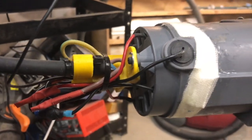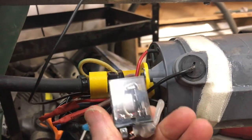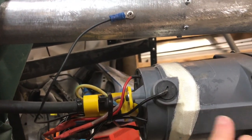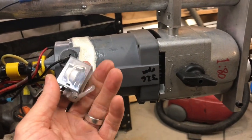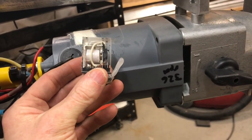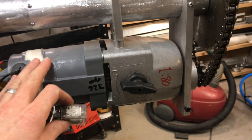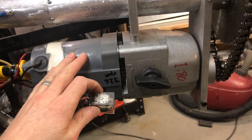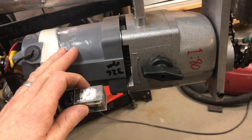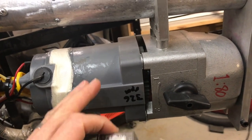Speaking of the utility vehicle, I had the same type of motor arrangement on those — just ordinary corded power drills. I used a high voltage relay to switch the current flow between the brushes and the stators to change the direction of the motor electrically and remotely. It turned out these relays are kind of wimpy for that. Even if you're just coasting with the throttle off, there will still be some magnetic field lingering in the stator, so you might get a slight short even switching to reverse at zero throttle.